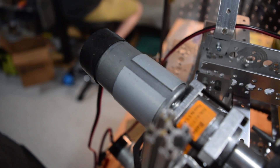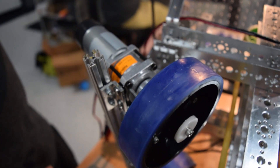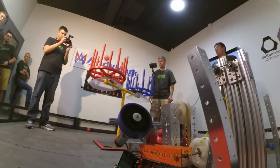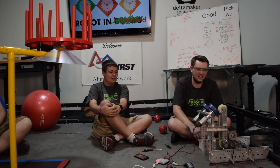We learned that the Andy Mark Neverrest motor is a 550-class motor, which refers to the size of the can, and there are a ton of different gearboxes you can bolt to a 550-class motor. As of last year in FTC, you can take a raw motor and put whatever gearbox you have on it, so we were able to dip into our FRC resources. We had a Banebots 4-to-1 gear ratio gearbox that would give us about 1600 RPM. We knew that was higher than needed, but there would be some inefficiencies, and being able to shoot further is good because you can always slow the motor down with the speed controllers — you can't make them go faster.